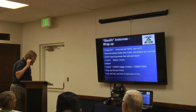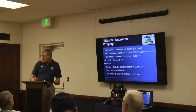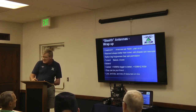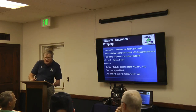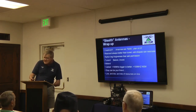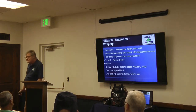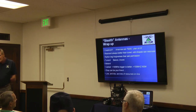Especially for HF, you are going to have to get to know tuners. If you want to do HF, you're going to deal with tuners. Don't be afraid of them. It's a little pricier than some of the others, but this MFJ 929, I've actually got another one I use with my 857, and it's a great tool. Baluns and Ununs, again. If you're going to do HF stuff, you're going to be dealing with baluns and ununs. And there's a lot of good articles on the net, so don't be afraid of them.